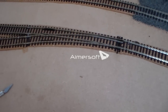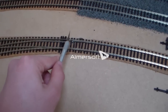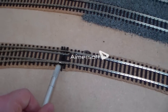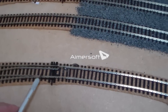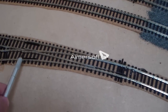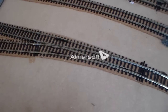Now I'm going to explain to you how an Electro Frog Point actually works. Because this is separated from the rest of the layout, I have put in a feed from the power bus — so here we have our positive and here we have our negative. The positive comes along, goes down the stock rail, right until the very end — no problems there. Our negative comes along here, goes through the frog because it's all metal, and stops. That prevents the short circuit. Now if I throw the point, our positive comes along here, across the frog, and stops there — therefore preventing a short circuit. The negative comes down here as normal. And that's how an Electro Frog Point basically works.